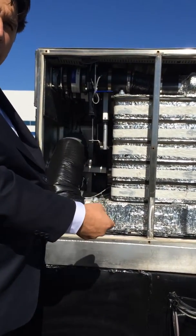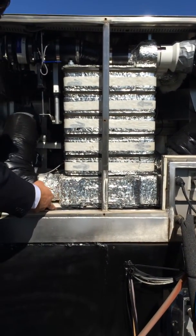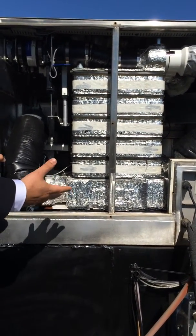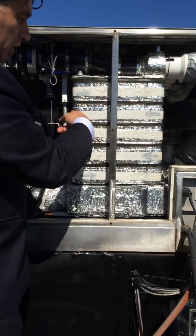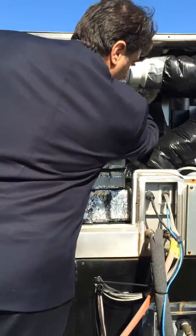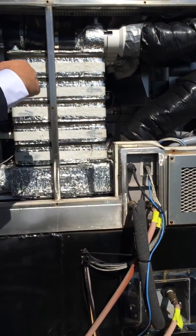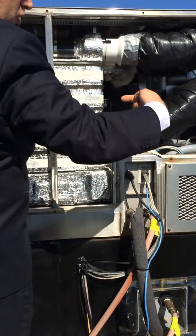So it's going to heat the fluid that's in there. And that fluid heats this metal bar underneath here, which is essentially a radiator. It's like a car radiator, and that generates the heat, which is blown across the desiccant stack. And there's a hose back here that will ultimately feed the hot air right back into it. So this is a closed circuit like this.